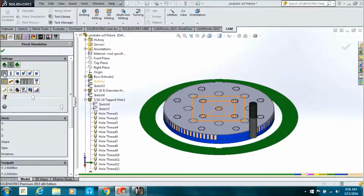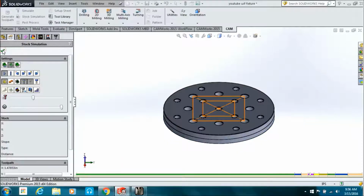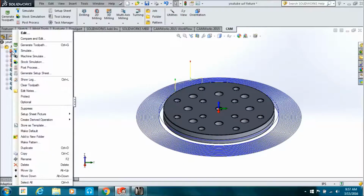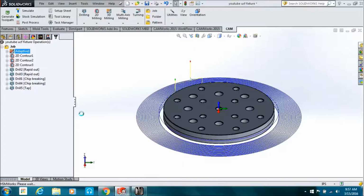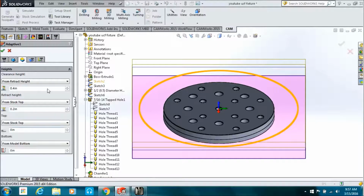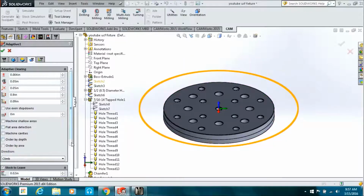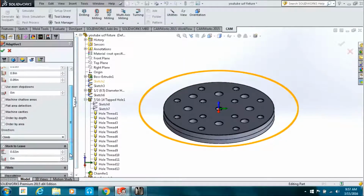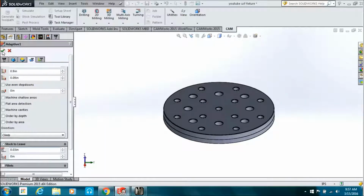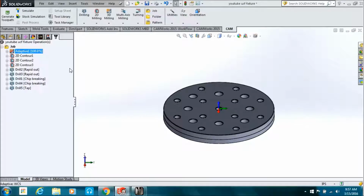I think I'm going to have to flip those contours up and down. I tried to go and leave more material and it didn't work. Just the chamfer on the top of that part right there. And this is where I go back in, I'm editing it, trying to leave more stock. I'm leaving more stock on the adaptive, hoping that it's going to leave stock, not leave those marks. But what I'm gonna have to do is do the top contour and then do the bottom contour. Is the only thing I can think.